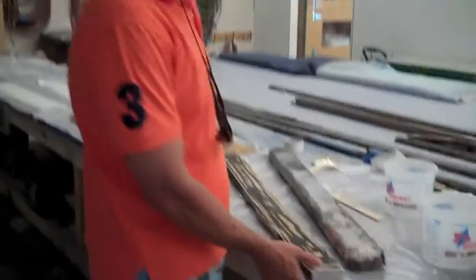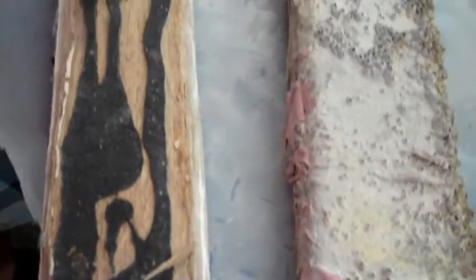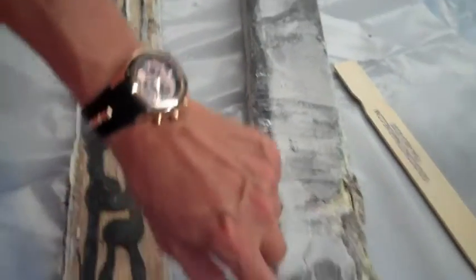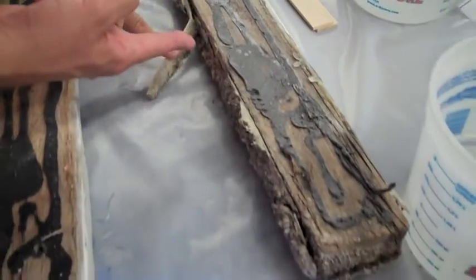If you look over here, these are called trim tab planing blocks, which they attach trim tabs to. You can see this was either a hunk of strong plywood or mahogany that they just had caulked on with a couple of screws. It got broken — and it breaks really easy — it saturates with water, starts to get delaminated, the glass pulls off, and it grows barnacles on it.